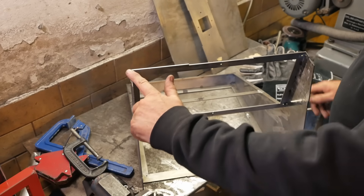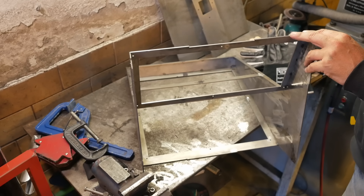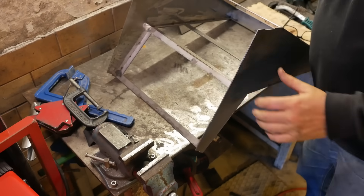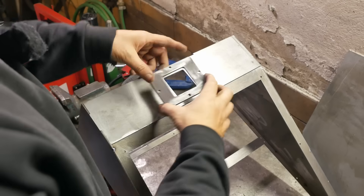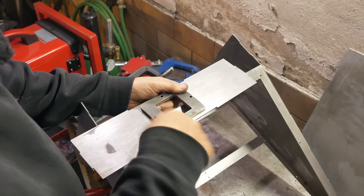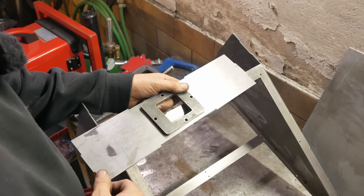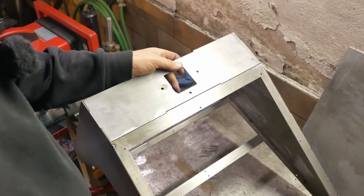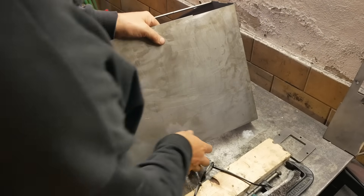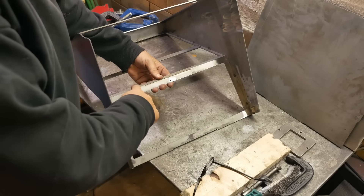I don't get it — I'm missing a piece. I don't remember seeing it at home, I looked in the car, it's not there. I'm sure I put both pieces in the laser file, but maybe I didn't. This mount piece is going to get a nice big reinforcing flange welded on the inside of it. I'll see what it feels like once I've done that, but I may even put a little piece of tubing and some diagonal supports on there. I guess I'll see once it's all welded up whether it needs it — it's going to be pretty rigid anyway. Then this base sheet — being quite an open angle it doesn't have much interlocking, so it's going to need filler to weld through there. I think I'll weld that before I put the base on.